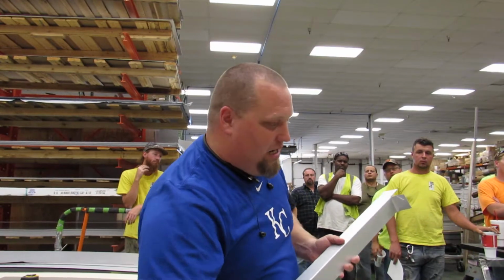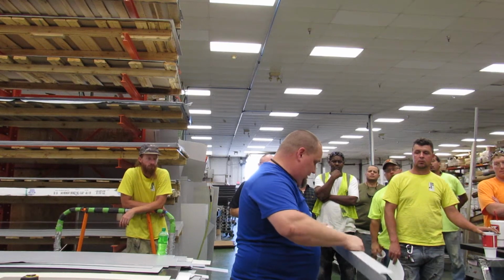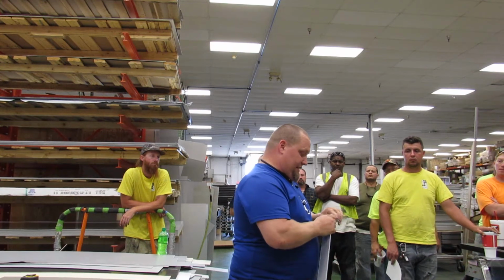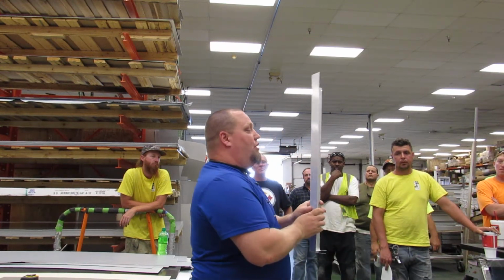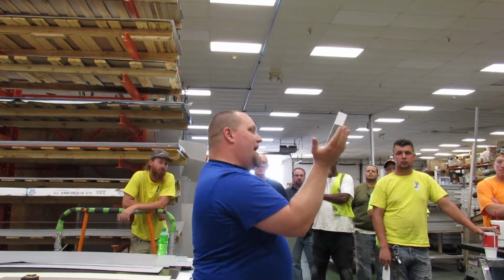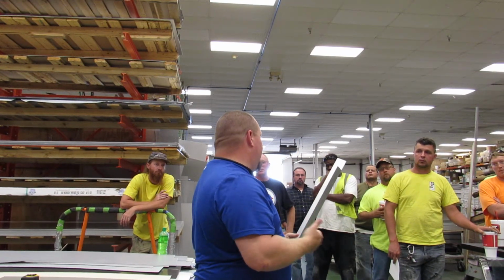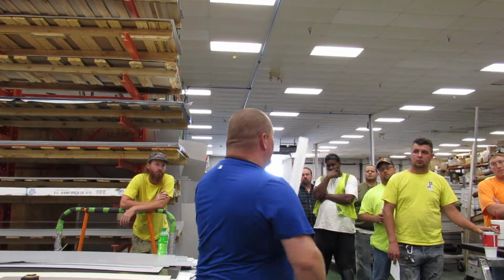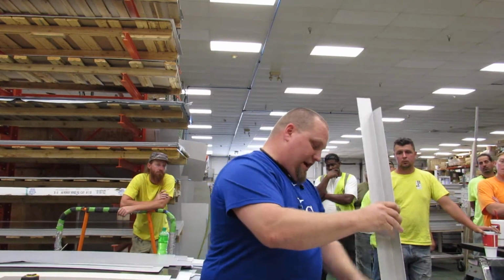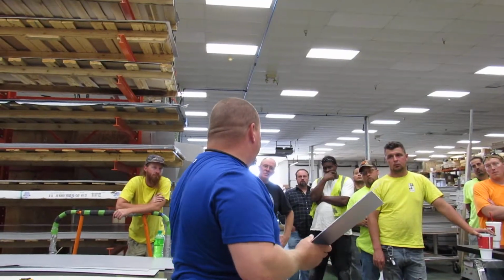One of the ones that I didn't do a sample of is your corners. If you cut an inside corner, I'm just going to bend these under just as an example. If you have a corner brake metal that we're putting on an outside corner or in a curtain wall, top and bottom, you have to bend about a 1-inch tab minimum so you can get backer rod in there, and it needs to be in the same plane as your primary caulk joint. If we just set an inside corner to the ground right here, and we try to run our caulk joint all the way through, we're caulking to 040 metal.